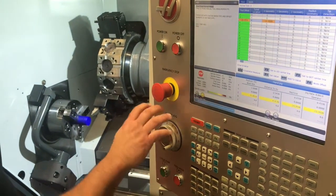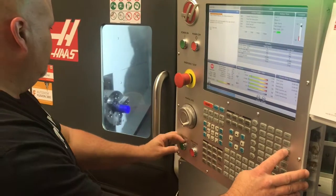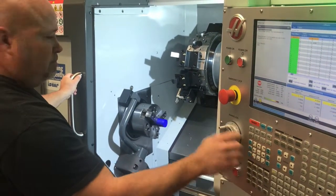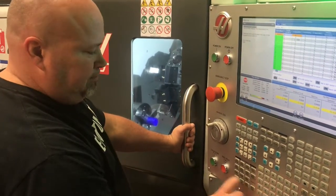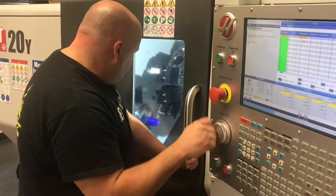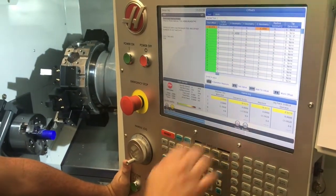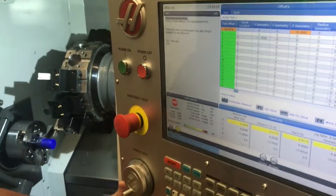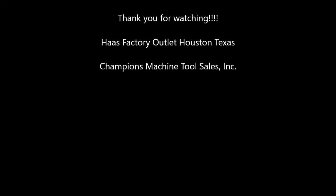Now that we've got these two values populated, I'm going to show you where the numbers are coming from. I'm going to dial away a bit in Z and make a tool change over to tool number one. With tool number one in place, we're going to touch off the face of that part. What I want to show you is the Z-axis geometry for tool number one — when I press Z face measure, it's going to be a small positive number. That just means that this tool is 409 thousandths longer than the base reference tool we've used in this example.